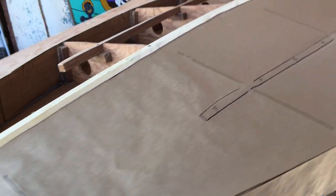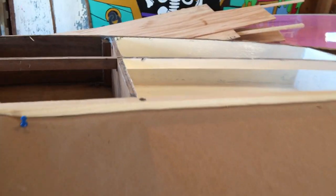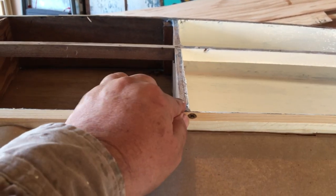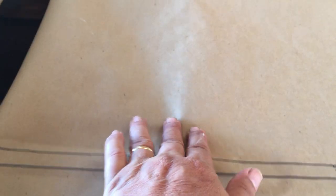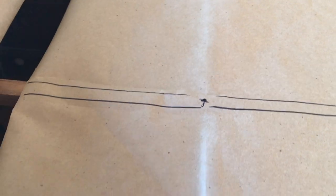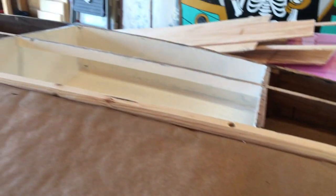We'll also mark where the little frames are at, just kind of as a reference. But I especially need to mark where they're at back here, because this is only a half-inch thick piece of plywood. There are nails here going down, so we'll piece the paper and mark it with our little Sharpie so that we know where to put the nails in — they need to go into that bulkhead.